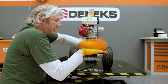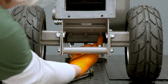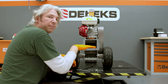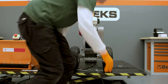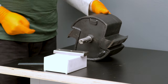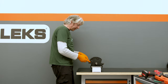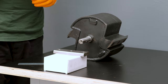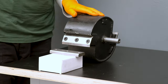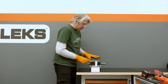The distance between the fixed blade and the rotary blades is very critical for the optimum cut. On a Deluxe machine, that's easy to adjust. You can see just under here there are three bolts that hold the static blade down — undo those slightly — and further back there are three more bolts that help adjust that blade in and out. With the drum out of the machine, it's much easier to see what's going on. You've got two blades, one on either side of the drum, and either edge of those blades is sharp. Should it start to blunt out in the field, you can very quickly take the blade off, spin it around, and put it back the other way — and that way you can go for twice as long. The three bolts push the fixed blade in and out. In the kit comes a little spacer — pop it in position, push the blade into position, do everything up, and you know it's exactly the right distance between the blades, giving you the perfect cut.